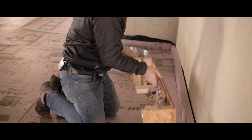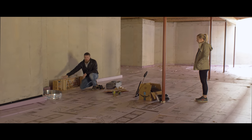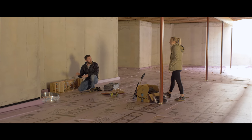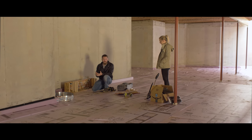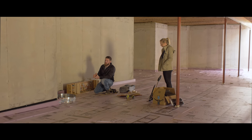Holy hell, that's a lot. All right, so in the basement, we're actually gonna have two separate zones. This one is just going to feed the two bedrooms and the bathroom. And that way, when nobody's staying down here, we're not wasting heat, and for two, when you're sleeping, you technically want to be able to turn it down so you're a couple degrees cooler.